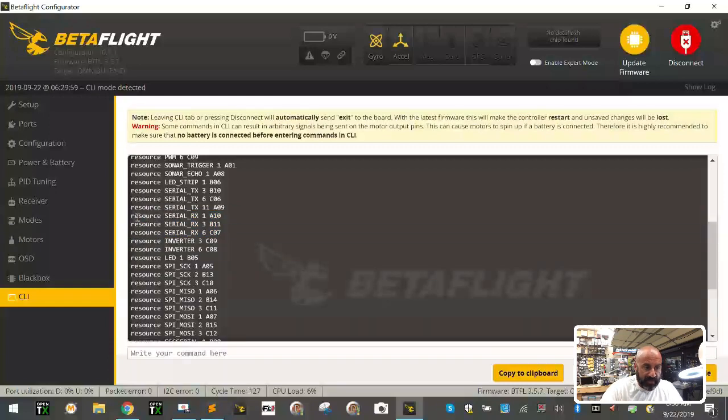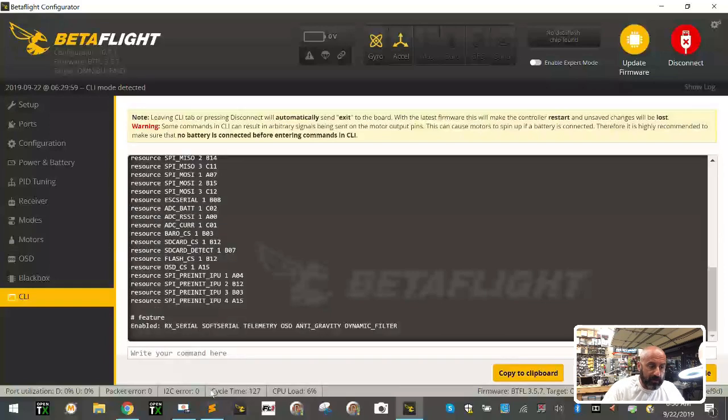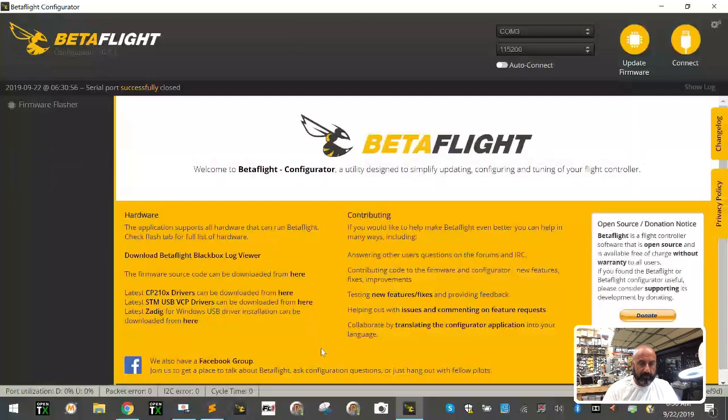All right, with that done, we are now going to type in the following. Type in feature, okay? And there's a reason for this. Type in feature, and you wanna make sure you have RX serial, soft serial, and telemetry, these three things, okay? Just make sure those are there. If they're not, then you need to go back and make sure that you've activated the following, okay? And to do that, the soft serial, you turn the tab on, the telemetry, you turn the tab on, okay? All right, now that that's done, we're gonna type exit. And make sure you click save, okay?